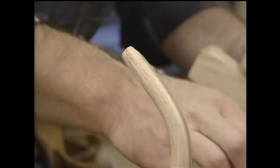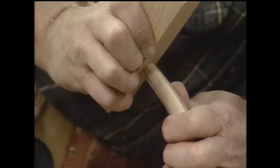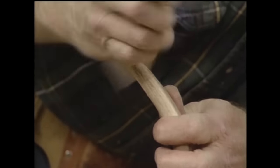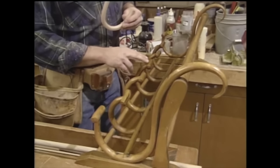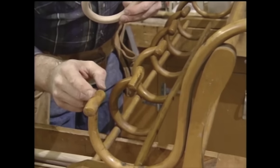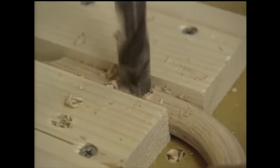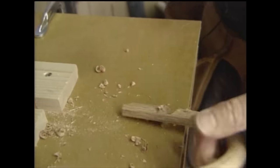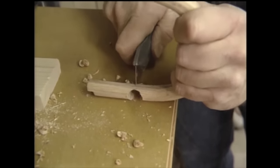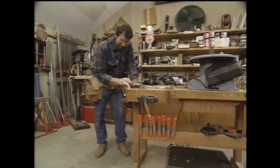I've taken a scrap piece of wood and drilled a half inch hole in it about three-eighths of an inch deep to use as a test piece to check the fit. That's going to be good, so now I'll just sand it smooth with some sandpaper. For the remaining hat hooks, this end is tapered just like the S-hook. On the other end, I need a half round cutout to fit the dowel. At the drill press, I've installed a five-eighths inch diameter bit — the same as the cross dowel — with a couple blocks of wood to hold the piece securely as I drill through. That gets most of it, then just a cut with the mat knife, and that will fit the dowel perfectly. A little more shaping on the small hooks and some final sanding will take care of it for today.